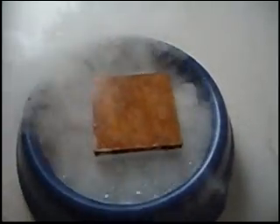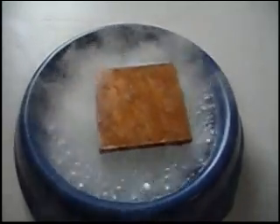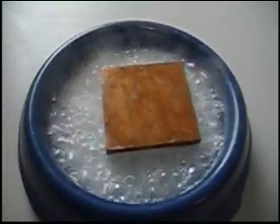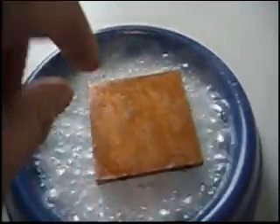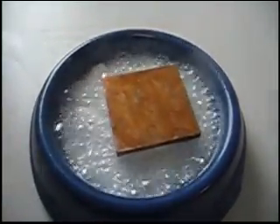The CTE mismatch is exacerbated by the top of the copper being in ambient air and the aluminum being against the liquid volume. It's still a little warm there — it's actually hot. There's a huge CTE mismatch. This is definitely the worst case.